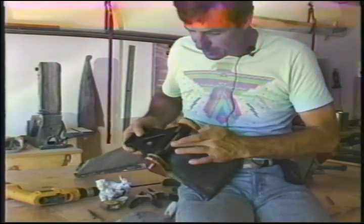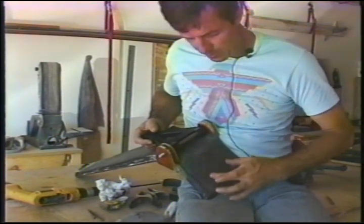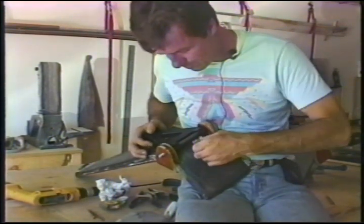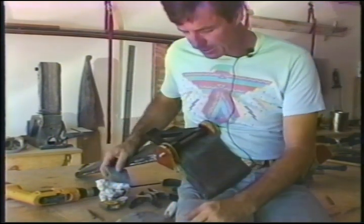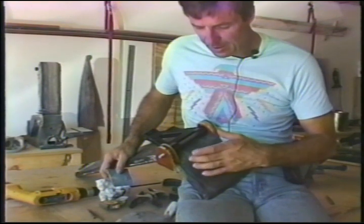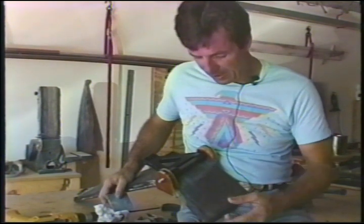You notice how that sits right there? We're going to sand the area directly beneath this. I'm going to mark that area, and I'm going to sand all the way down to here. From there, go considerably wider than just this width, because once you've done your layup process and put in your bushings and all that stuff, you can use those sanded areas adjacent to these things for fill material, because you're going to fill this whole gear leg eventually, so that you really clean it up cosmetically, so it's always easy to clean later on after you've painted it.